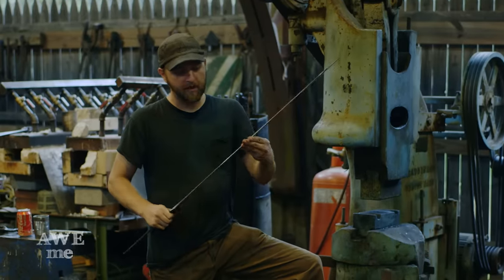In the game, the sword has a very heavy all-iron handle, so I'm going to be using ironwood to reduce the weight. After using the drill press to drill my central hole, I burn the handle under the tang. We got our handle slotted. I'm going to go ahead and grind it — in the game it's got a real angular, aggressive handle. So I'm really going to put some big scoops here, knock the corners off, taper this in to fit our pommel, and we'll be good to go. We now have our elaborately beautiful Damascus blade polished and etched, our guard constructed and polished out, our handle sanded to shape, and our pommel ready to go. We're almost ready to slay ourselves some demons.